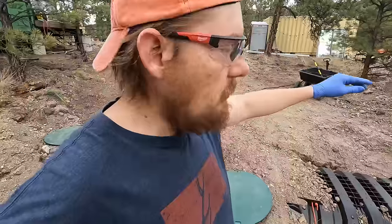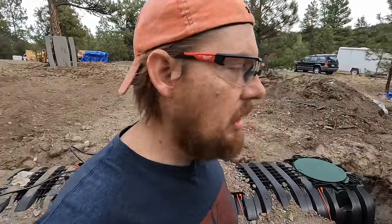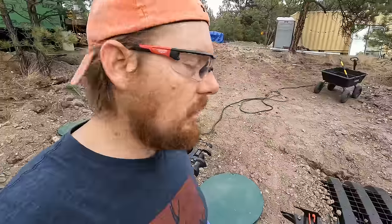And then when that tank fills up, it will start pushing black water down into the septic field, which has not been created yet. I'm going to put about 150 gallons of black water in each one from the RV, and that way we can weigh these tanks down as well as empty out the RV for the next freeze. So that should work out pretty well.